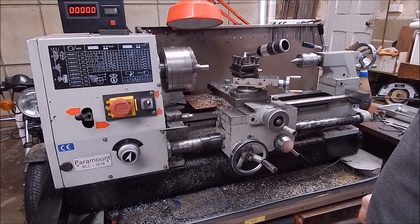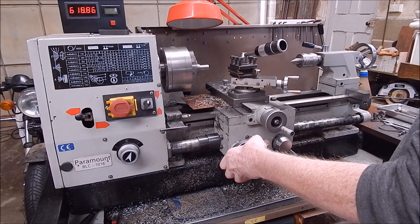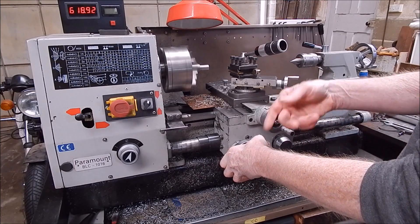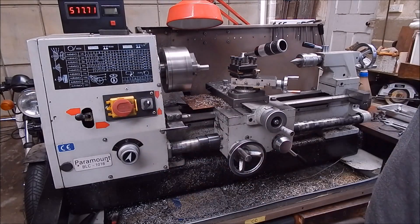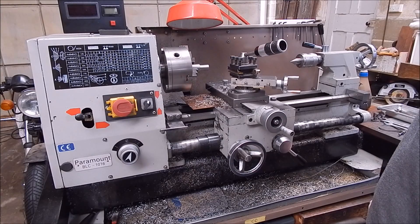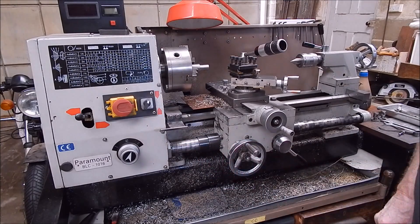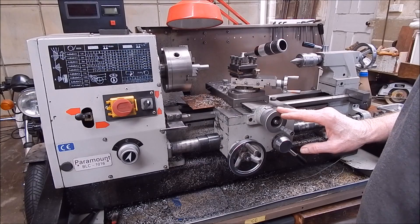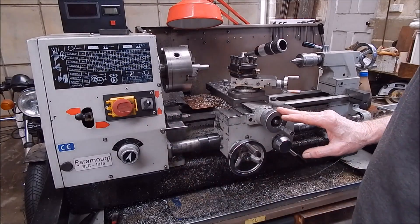Pulling the drive — look at that, it's going. No, it's not. That's just the drag on the two parts. Pulling along, but the shear pin is broken. So what happens when the shear pin breaks? Well, hopefully not much, because that's why they put them there. If you haven't got a shear pin and you crash the carriage, you've got a good chance of doing some serious damage.